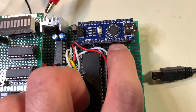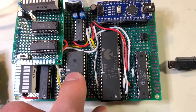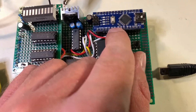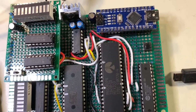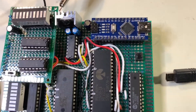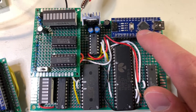The reason it's generating the clock signal is a legacy reason. This is based on an older design where I used an Arduino Mega — at that time I didn't have an EEPROM chip, so I was using the Arduino Mega, tying it in directly to the address and data bus, and using the Arduino Mega as an EEPROM. As I got an actual EEPROM chip, I didn't need that anymore. But in terms of how the serial works, I wanted to make sure the CPU was in sync with the Arduino — I didn't want it to catch the Arduino in some interrupt state, or if the CPU was moving too quickly and changing the state of the buffers.